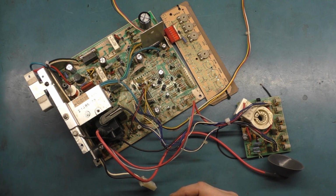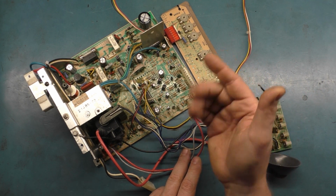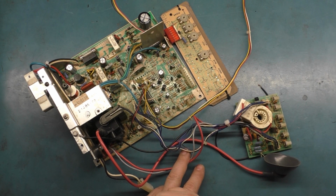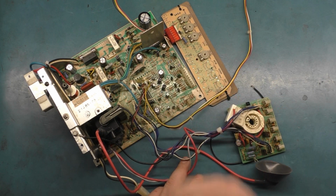Because the test pattern generator has a higher output, so of course, with these being up to wherever they're okay at on a normal PCB, where the HOT is not blowing up, as soon as you hook up the TPG, kaboom, it blows the HOT. So, the only way I could get that to stop happening was to turn brightness and contrast down all the way completely. And then as soon as I tried to turn it up, boom, it'd blow the HOT.